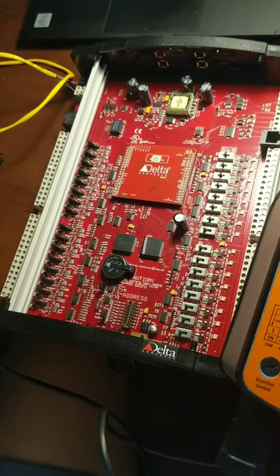Don't ever short the feedback wire. That green wire is just the feedback signal. Don't ever short it. It would be good habit to put a meter on it. Right now it's at the failsafe position. I'm going to send 10 volts to it. There we go — you can see it starts moving because I just sent 10 volts to it.